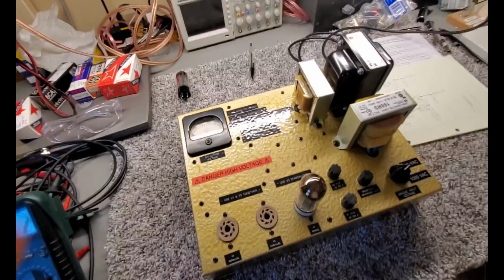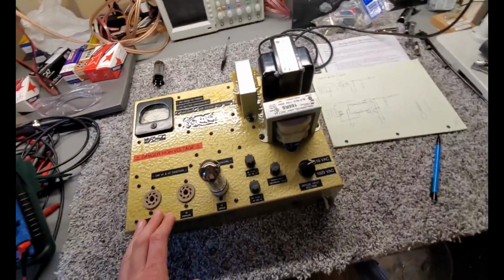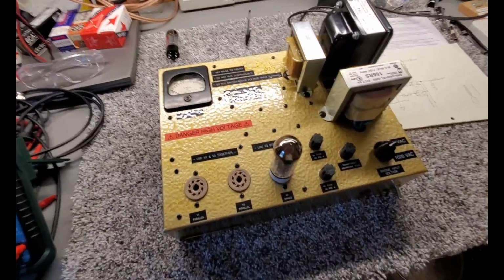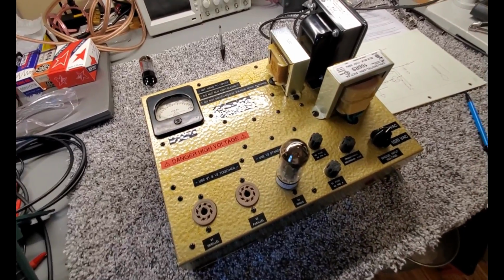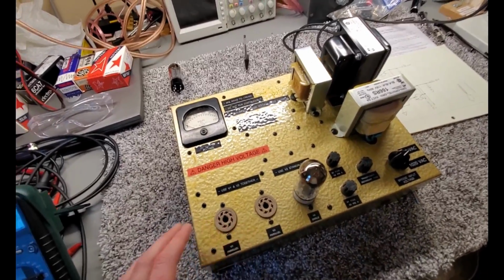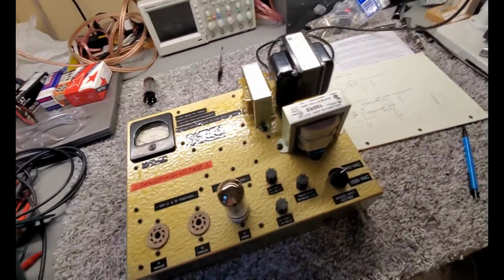So we had to build this, our rectifier tester. And from that startup condition, what we learned is it was very clear that these tube manufacturers really just kind of push whatever they make out into the market. So, we buy these tubes from maybe the manufacturer directly or a distributor, wherever we get them from. It was very clear they haven't been tested, because we had a batch of these tube rectifiers that were failing at half their rated voltage.